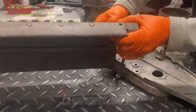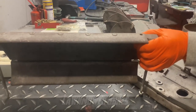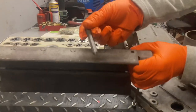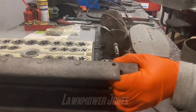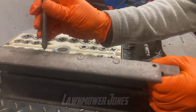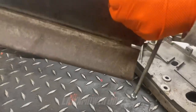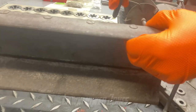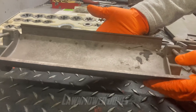Another option: you could just drill them out. Another option I tend to do quite often is soak them and use something like a punch and undo them that way. But what I'd suggest when you're hammering is to hammer against the back of the block rather than the other way, because on this one especially I think if we hammer that way we're just going to end up with a lot more damage. So if I was using this I'd try to undo it and hammer from the strongest part.